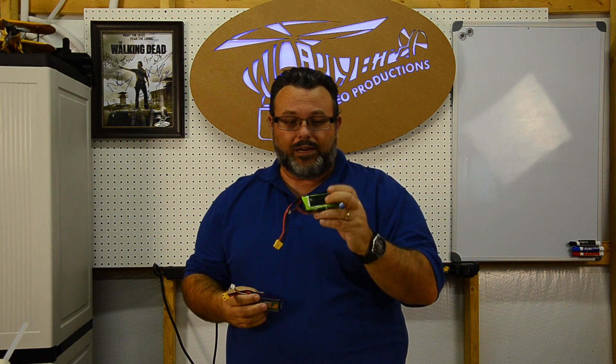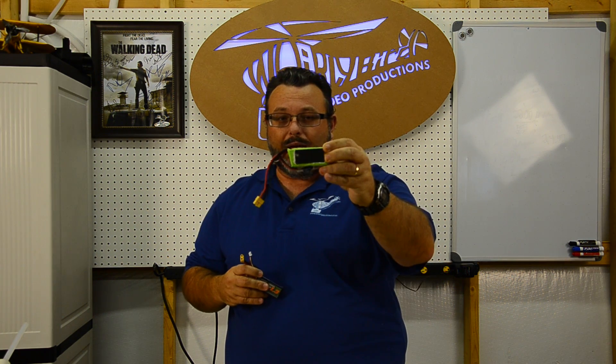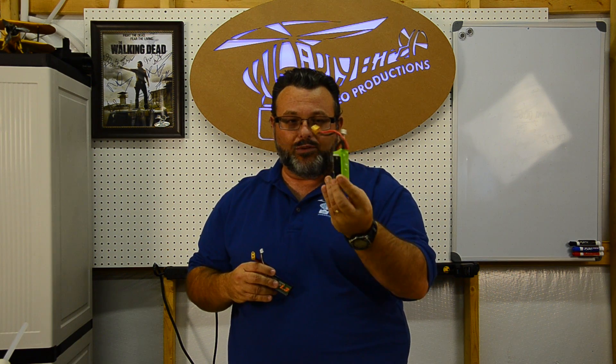The first thing I want to talk about is battery chemistry. Every single one of these up here are LiPo batteries except for one. If you've done like I did and put Velcro over top of where the label is, it's definitely a different color. I know this is a LiFe battery. Other telling things are the little connections that go to receivers. This is a LiFe battery, this is a LiPo battery — they look a lot the same. So make sure you've got the chemistry right when you're charging. If your charger is set for LiPo, don't connect a LiFe to it or you'll overcharge it and damage the battery. LiFe is L-I-F-E, LiPos are L-I-P-O.